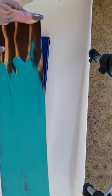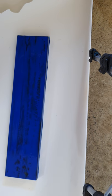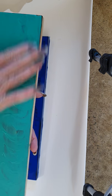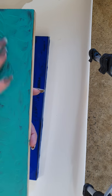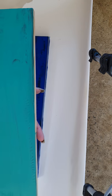I've folded myself in half basically — I'm sitting on a crate and bending over. All right, here we go: first of all I just put on a little bit — that was only probably five mils if that. I go along and touch up my sides normally, but I haven't burnt them so I'm not going to bother. Once I've got it on and I've got good coverage, I then just go and work it in a little bit — just like that. I use my hands; it's non-toxic and water-based, it just feels so good to work with. If you've got tactile sensitivities you can use gloves. Once I've worked it in, I just go and get a nice finish going — good coverage; it doesn't have to be neat but go with the wood grain.